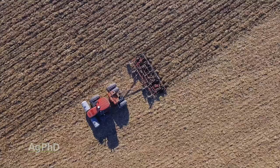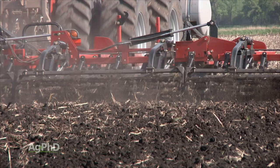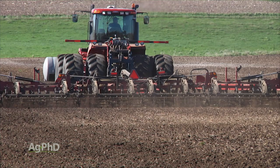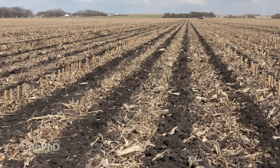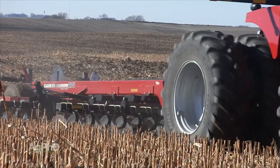We see a lot of different tools being used in this application. The question is: do you want a finished seed bed right now with fall tillage, or are you going to do some more tillage in the spring? We see a lot of work done with high-speed discs and field finishers — there are a number of different tools that could fit the bill. When it comes to residue management, it really starts with the combine, so just take a look at what you're doing, get a nice even spread, and regardless of what tillage system you're in, we always care about setting ourselves up well with a good seed bed for next spring. One thing you may also knock out with your tillage this fall is our Weed of the Week — we'll show you how to stop it, coming up next.